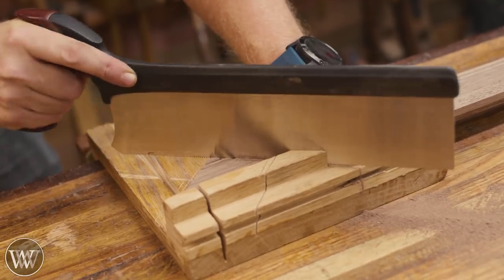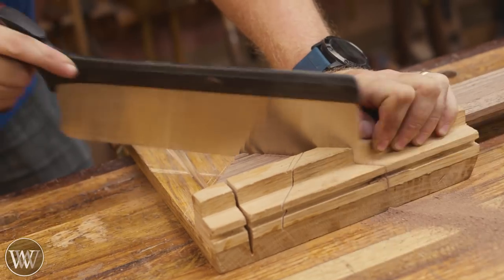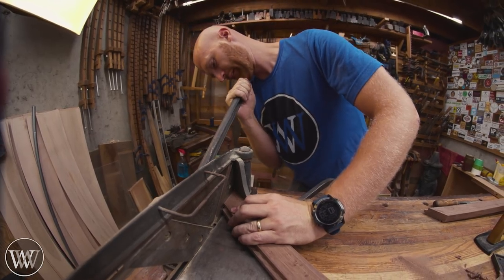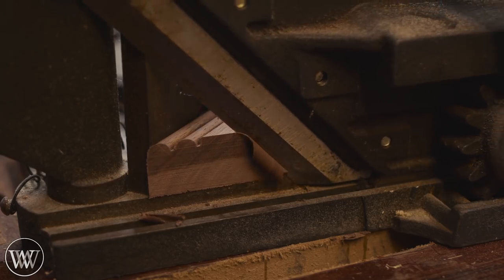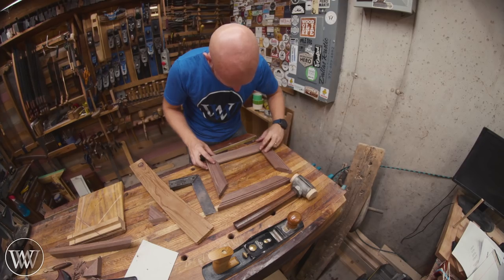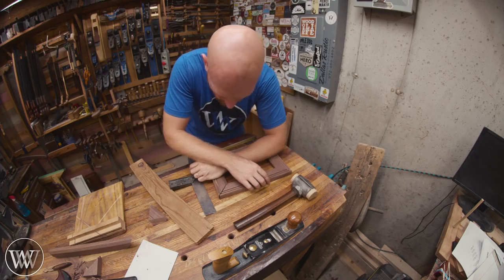Now that I have them cut at 45 and I know they're nice and true, I'm going to show you another way that I often do it — and that is with a miter shear. Once I get them close to the line I can put this miter shear on there and get a really nice clean cut. It's a joy to use, gets fantastic curls off, and works basically the exact same way as a shooting board but takes a lot of material off much faster. A lot of professional picture shops use a miter trimmer rather than a shooting board.